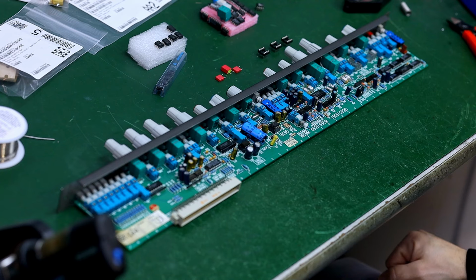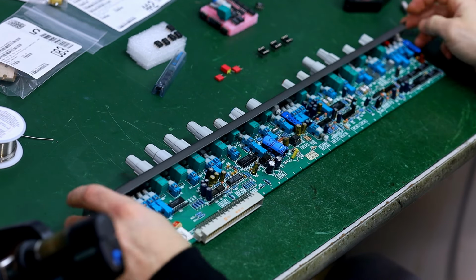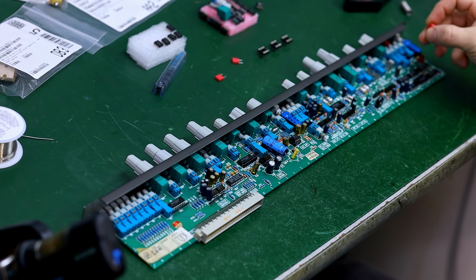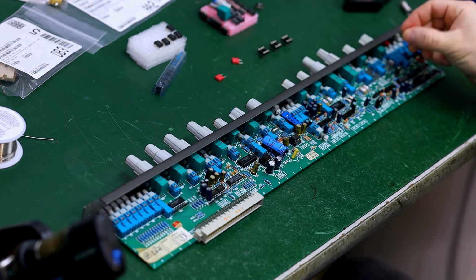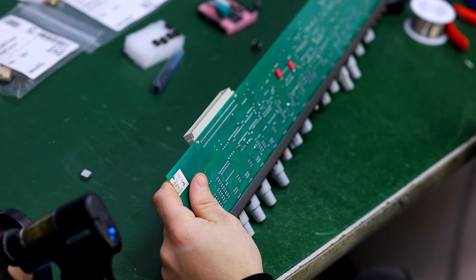The low frequency cutoff, which is right here, is like 110 hertz or something. So I put a bigger cap in here. It's basically double the size, which lowers the frequency a bit. Pretty much 80 hertz is where it's at. I've put this extra cap in here and slapped these guys back there.